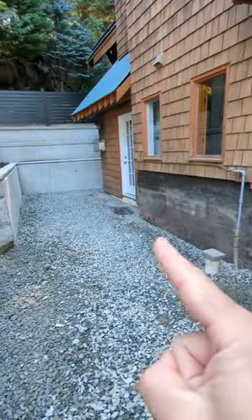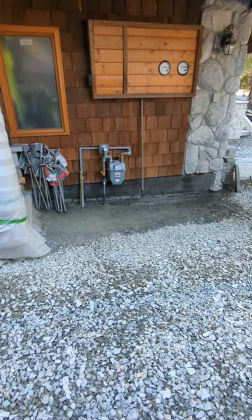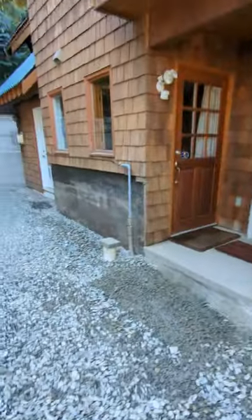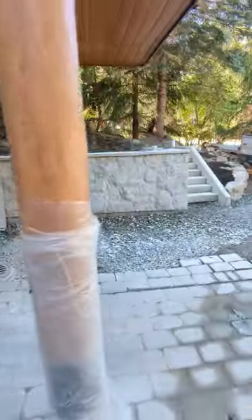My sense is to start with the new pavers at the back and blend into the old ones up here — or better yet, reuse the old ones first and work our way back, then use new ones at the end. The new ones are going to have the little spacer gaps and these won't, so we might have to have a soldier course border between the two. So that's paver step number one.